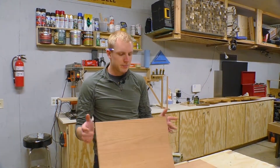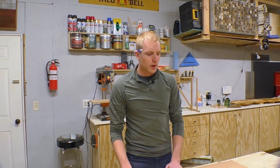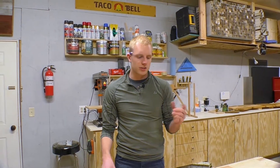These panels are dry enough to do the next step. To make the tolerances nice and tight, we are going to take about an eighth of an inch off total — a sixteenth of an inch on every side. We'll just need to make the final dimension a little bit smaller to account for that. So we're going to re-square these up on the table saw.